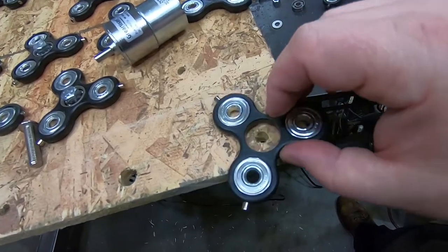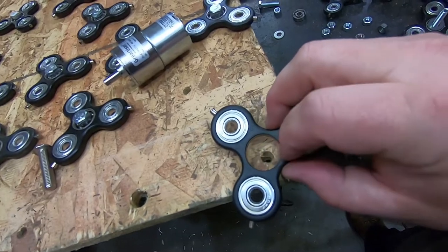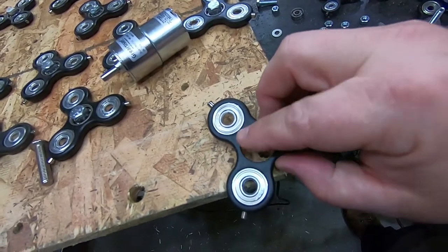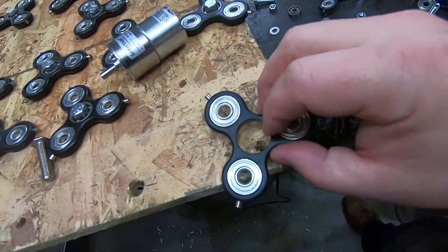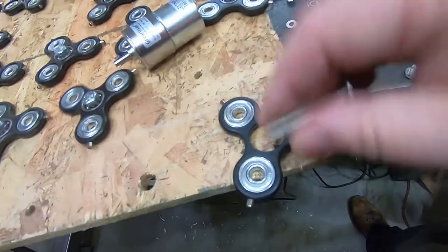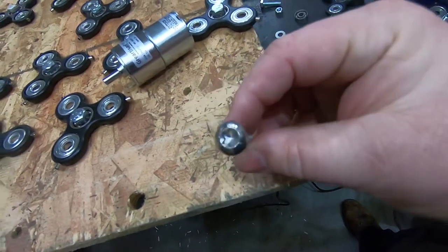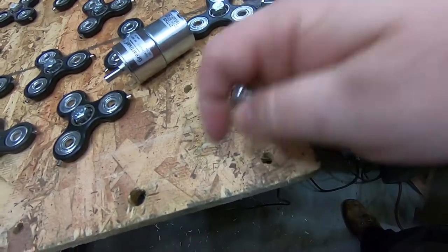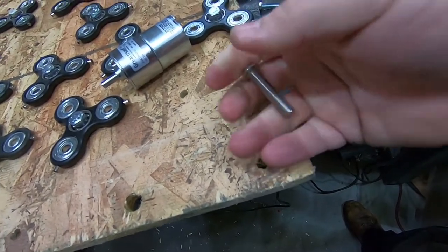So the solution I've come up with is, remove one of these bearings, obviously, and they're just press fit. So I'm going to make a replacement hub that press fits in there with a bit of a rim, I think, so it's nice and flush. And that'll be tapped for the 5/16-18. I keep dropping that damn thing. But this 5/16-18, which is what all of them will be, can be threaded through there. And so that's a unit.